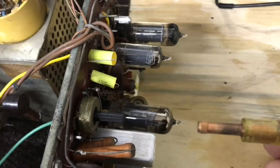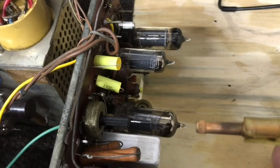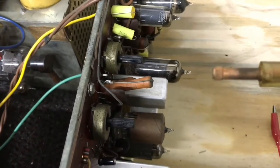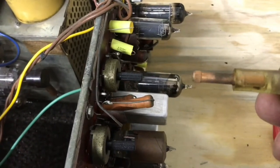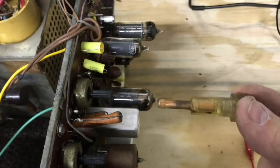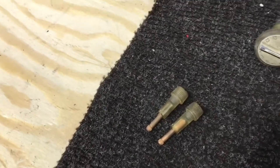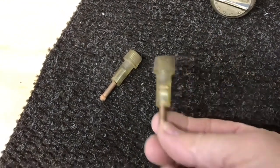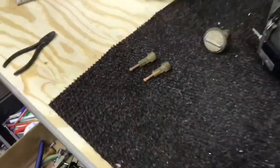The way they work, they've got a sleeve that attaches between the knob and the control. There's a metal shaft, but there's a sleeve that goes between those two points. The sleeves are all disintegrated and missing because they were made of plastic and they've broken apart and they're gone. So you want to come up with some kind of a sleeve to go from here to there, because the cabinet is here at the top. The same thing on the volume control. I'm also going to need one more knob for the on/off brightness, and I'll have to come up with a sleeve of some sort for that one too.